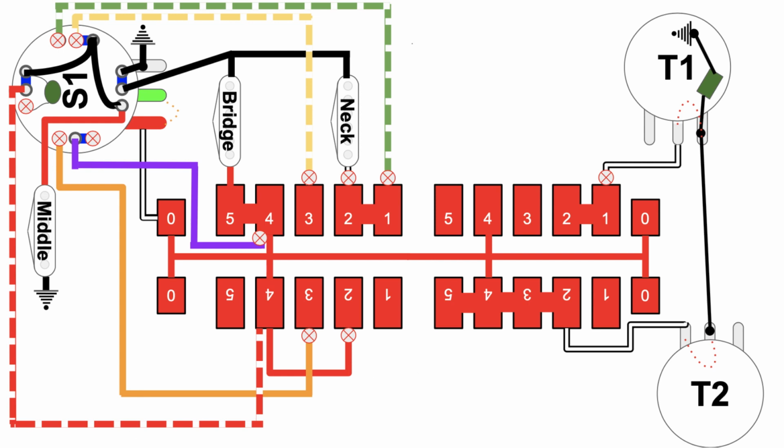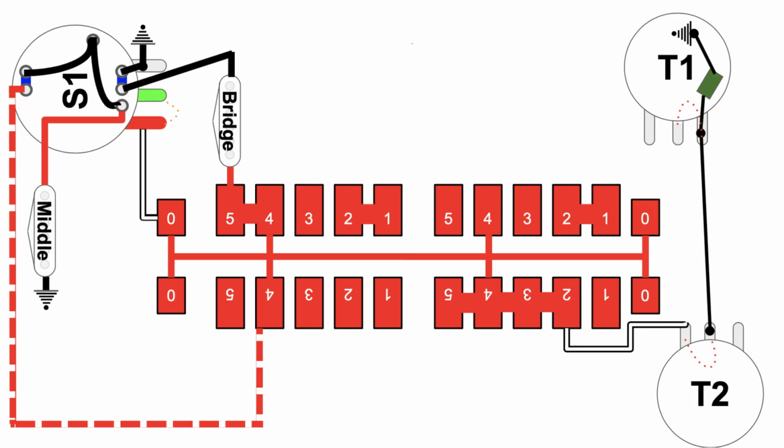Pause the video. All right, now let's take all of those parts that are pretty much not affecting things out of circuit. Okay, looks like we have 2 grounds in play. So we get this ground here coming up the middle, going up this way. It goes over these jumpers here, comes all the way around to number 4, and then finally hooks up with the backbone, the hot audio backbone of the super switch.